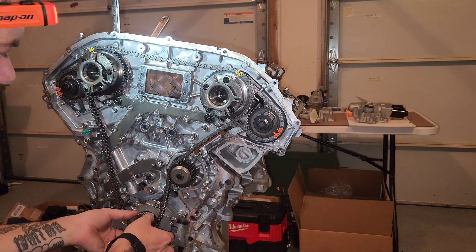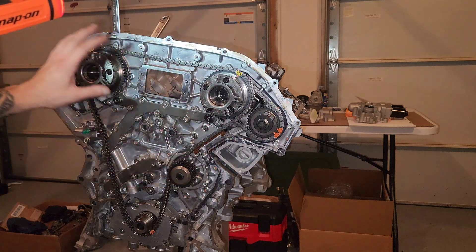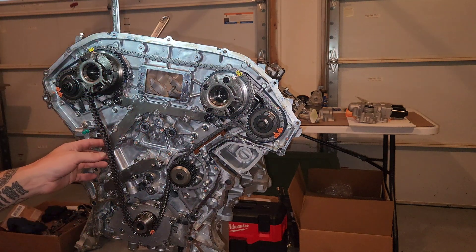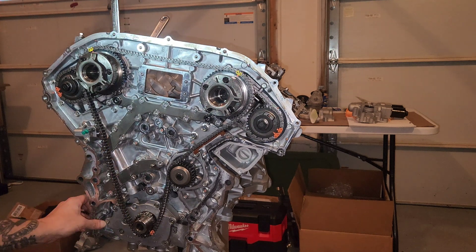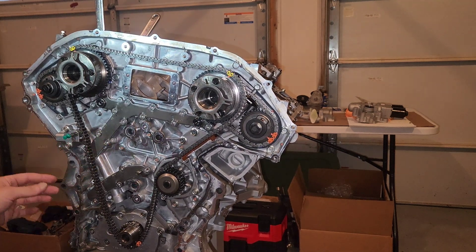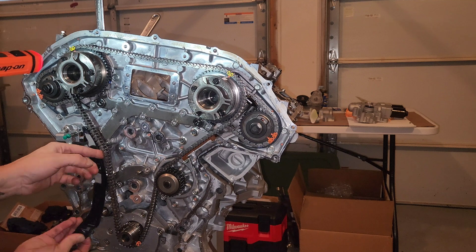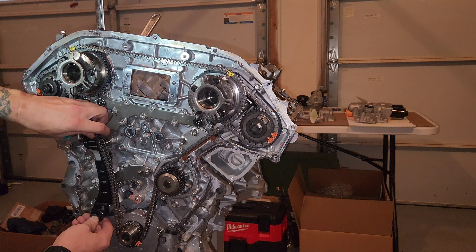You can see how I have it now — I've slipped the crank sprocket on, I've got everything sitting in its guides. I don't have my upper guide and I don't have my primary. What I'm going to do — you may have to walk the crank back or forward, plus or minus 10 to 15 degrees, to get chain slack in or out. Make sure you're on this and put a little tension right there, then slide the primary guide up into place.